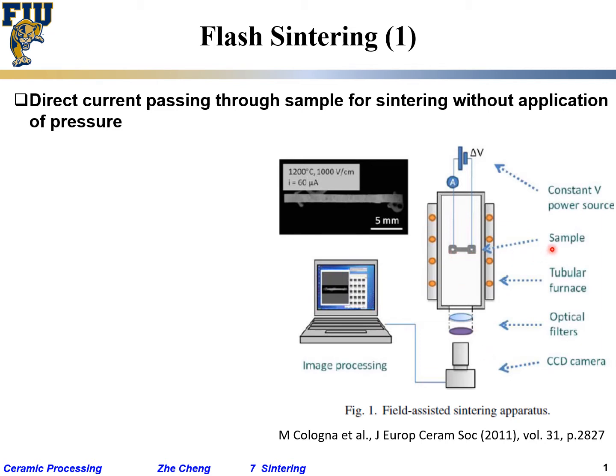Okay, so again, this part is the sample. You put that in the furnace, you apply electrical current. You see these two holes is actually where the platinum wire will go through the sample. And of course, when they did that, they applied some platinum paste to assist with the conduction of the electricity through the wire into the ceramic piece. Of course, in this case, it needs the ceramic piece to at least have certain conductivity. One of the earlier experiments they did was yttrium stabilized zirconia, also called YSZ, which has certain conductivity and is an ionic conductor.